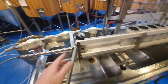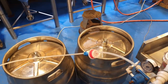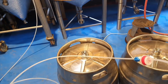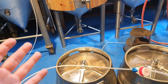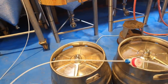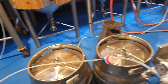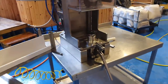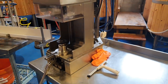Then I'll simply pop off these connectors and change this over for a Sankey connector, which will connect onto one of these 100 litre kegs. We take the beer directly out of the fermenter — we're doing porter today — and we mix in any priming sugar into the tank with any flavorings, such as natural plum extract for the plum porter. Then we fill the keg from the bottom up, which mixes the priming sugar and flavorings into the beer, connect it up, and send it through onto the canning line.